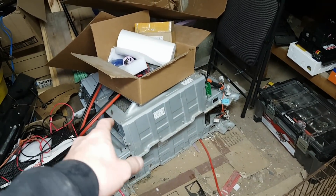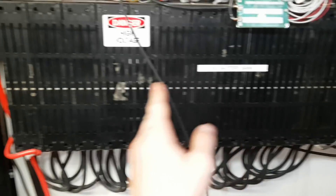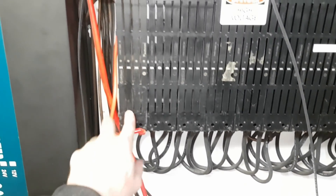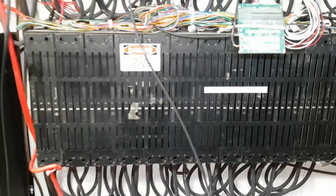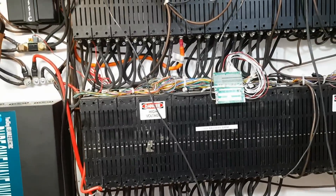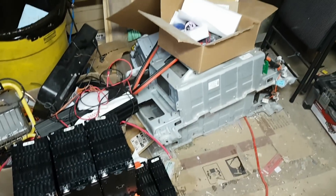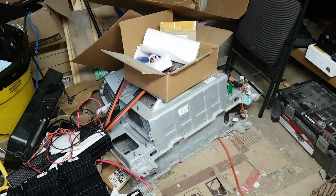I can't remember the kilowatts — I believe they're five amp hours. It comes with nine of these modules. They're five amp hours each at eight S. So eight S times nine, five amp hours each — you can do the math. Something like a kilowatt or so. I think $150 for a kilowatt is a pretty good deal. That's what I pay.